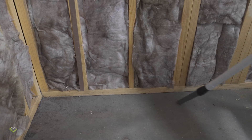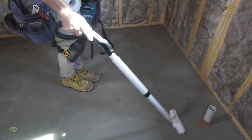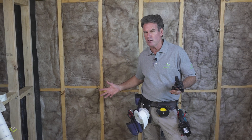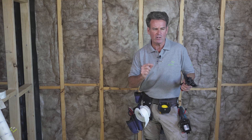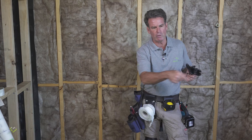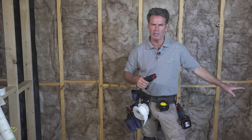If you're on a site — especially during winter with lots of mud — you'll find it gets terribly muddy and dirty on concrete floors at ground level, and you'll have all sorts of trouble trying to get adhesion to a very dirty concrete floor. One suggestion: before you frame the walls, or once the walls are framed and before the site gets really muddy, go around and paint a four-inch strip of paint around the perimeter. That way you can clean it come the time of putting the wrap in and you'll get great adhesion to the floor.